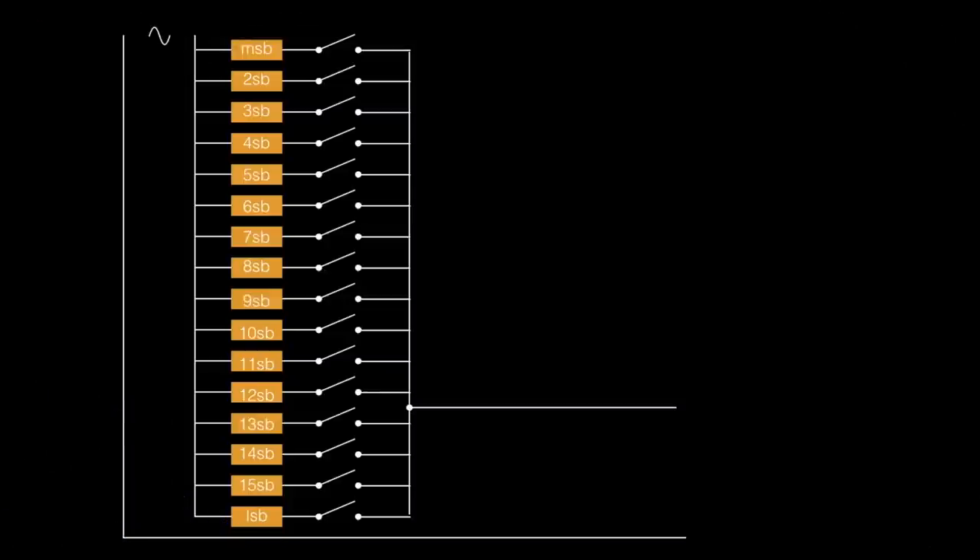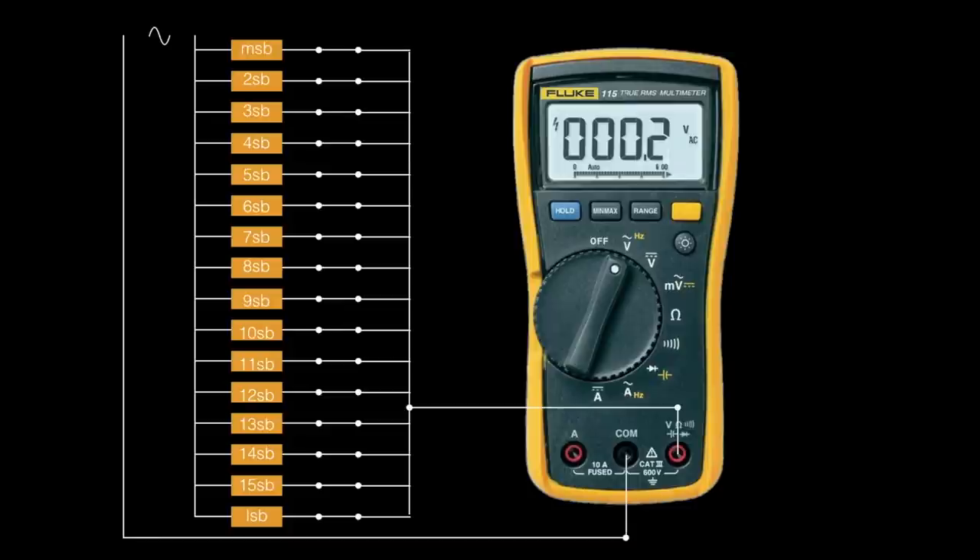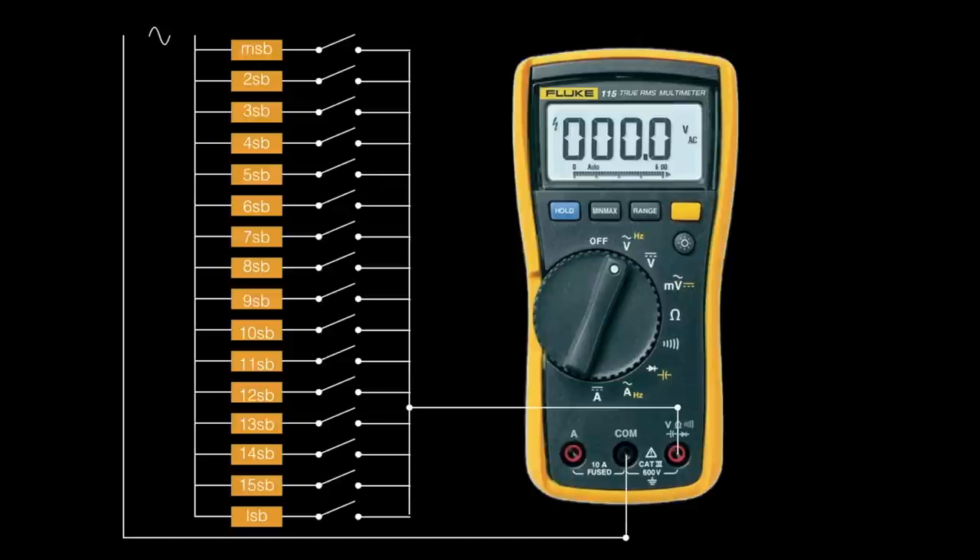A ladder converter is a circuit that holds a series of resistors. A 16-bit converter holds in theory 16 resistors, each one feeding half the voltage of the previous resistor to the summing line. If all switches are on, this results in 2 volts output. If all switches are off, there is 0 volts output. If the digital output is a 1 — the most significant bit — followed by 15 zeros, the output will be half the total output voltage, 1 volt. If the digital signal is 0,1 followed by 14 zeros, the second significant bit activates the second switch, designed to produce half the voltage of the MSB switch, so 0.5 volts.